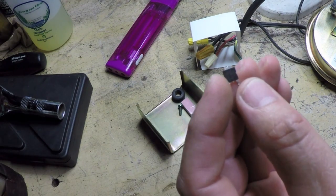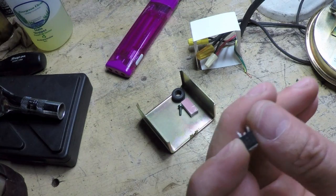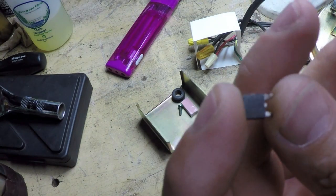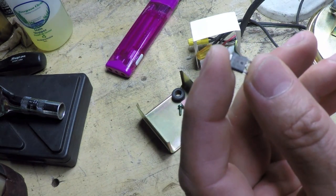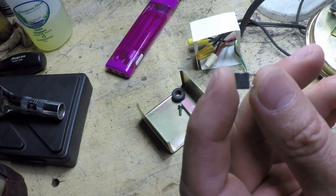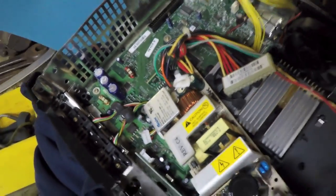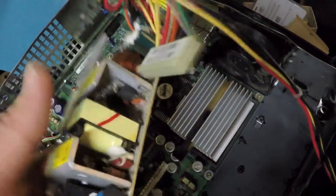What I ended up finding is this device here, which is quite a bit larger—marked MTD3302 by On Semiconductors, and it's an N-channel MOSFET. The specs are a lot different: it's rated for higher power dissipation and more current, so if anything it's going to make this circuit even more robust. That little tiny transistor was only driving a small relay, while this was originally driving something much more involved—most likely a switch mode power supply—because I stole it out of an old first-generation Xbox.